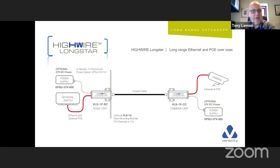An optional power supply is recommended. My advice is: the longer the range you're going over and the more you need to maximise your PoE, always put a power supply at the beginning — that way you'll 100% get what you expect at the end. If you want 25 watts, it'll deliver 25 watts. Many people don't put the power supply in — the camera works fine during the day, but when it switches into night mode and the IR comes on, the additional power draw causes them to drop off. Put the additional power supply in and save yourself the worry — and another visit to site.